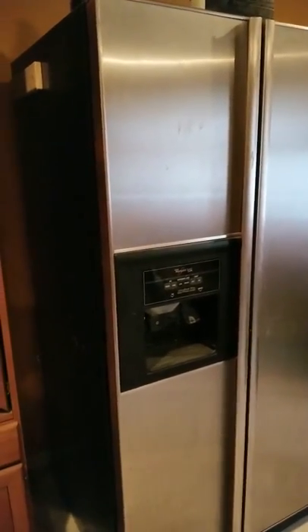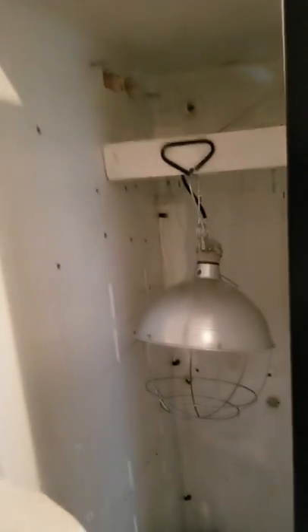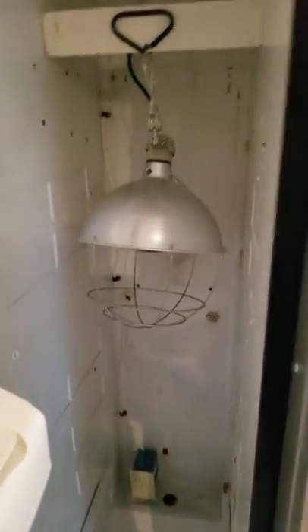Incubator version 3. In the other videos you saw, I had the humidity controller and the temperature controller mounted on the side, which seemed like a great idea, but I did not think about them being exposed to the heat in here, which caused a temperature controller relay to fail.